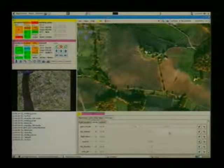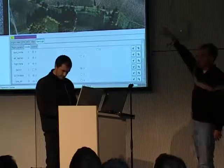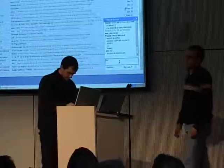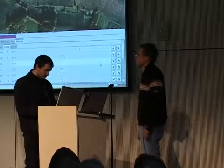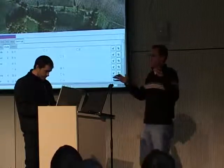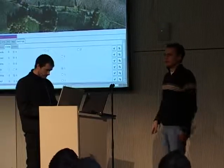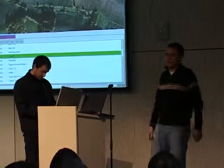So what we have here is a DSL connection. At the home, there's a house, and even though it doesn't look like it, you can get DSL in France, even if you are that far away from the city. And we have like 128 kilobits uplink, where we send the telemetry and the video. And in Hildesheim, we have a UMTS phone on the ground, which gives a little less transfer rate, so the picture from there will be worse. And we have a complete system there, so there's a security pilot and a laptop, and everything is set up so they can control the aircraft from here. And we just have a sneak entry to the system so that we can see what they are doing and we can move waypoints or change the flight plan or do whatever we want.